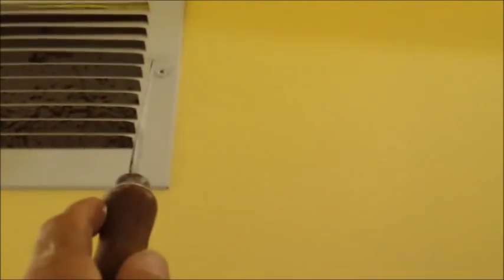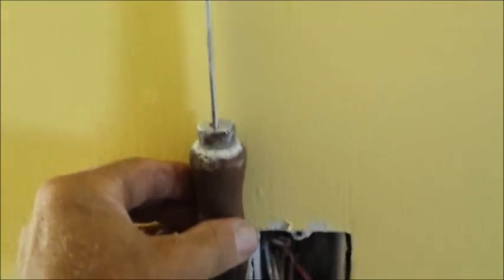We're back down here by the switch now, going to try to locate what we have. I've just taken this little drywall saw and I've poked in here, and I see there's a stud right there. This side here has no stud, so it's free. We know that the box is mounted on a stud on this side. If we even look up here, there's a return air there, and that stud is the same stud as this one. So now we know we have a stud cavity right here that we're going to be working with — we have to find that in the attic.